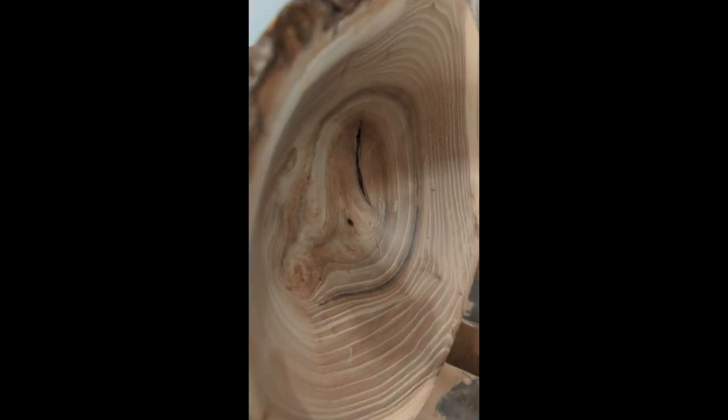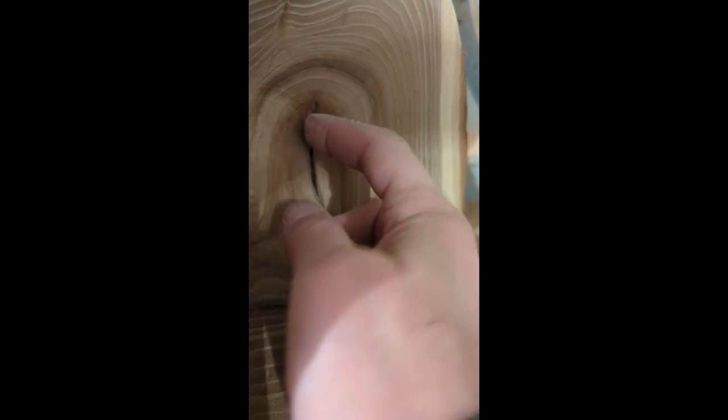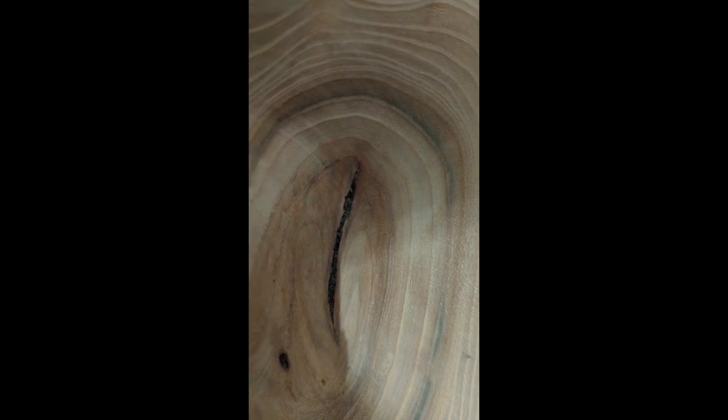The repair doesn't mask it completely when I first fix it with coffee — it's still noticeable — but there's a little bit right there that isn't filled yet, so I'm going to put another coat on. The super glue CA glue gives it structural integrity that makes it stronger than the original wood was, so there's no concern with any damage on the lathe. The coffee is just mixed in to give it color. I'm pretty pleased with how that repair turned out overall.